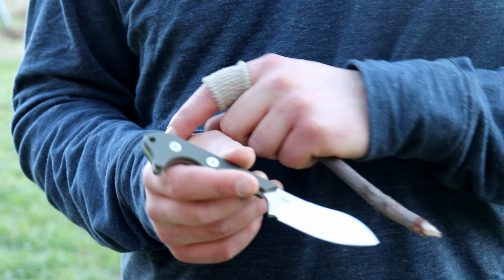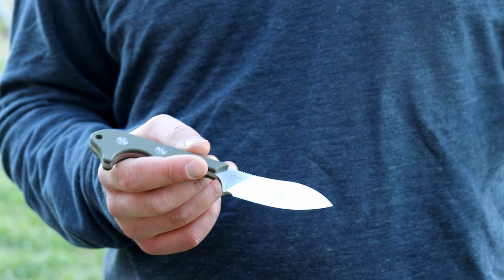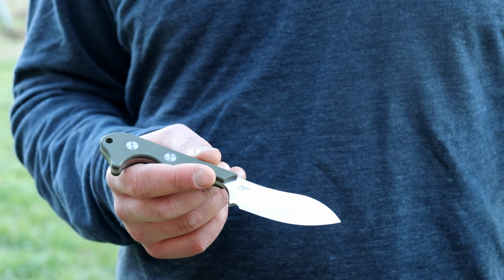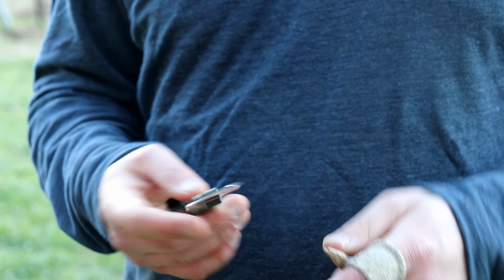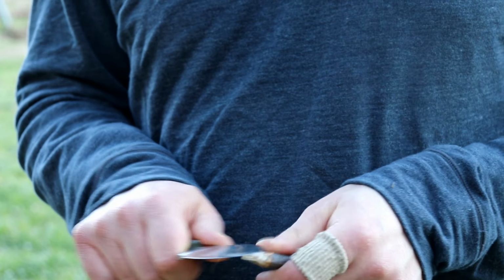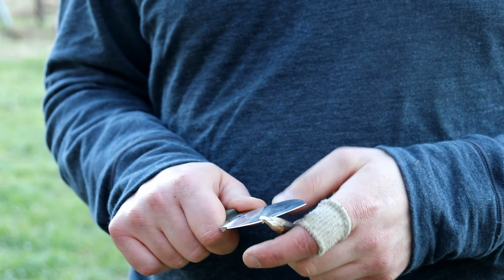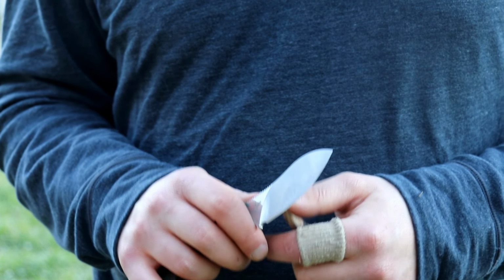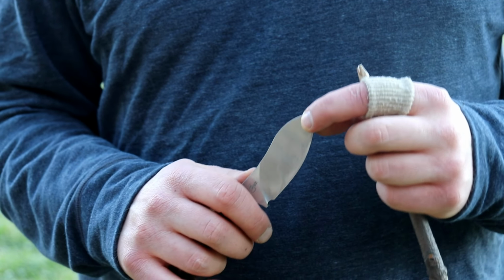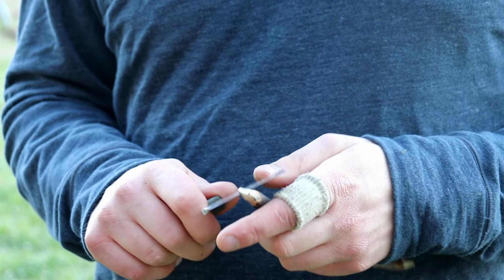Carbides are very important for every steel. Some steels have more refined carbides, some have really big carbides, and some have a lot of volume of carbides and some don't. This is all important for the performance of the blade. Ideally you want small carbides and not a lot of them, but D2 has really big carbides, and a lot of the chromium is in those carbides, so they are chromium carbides basically.